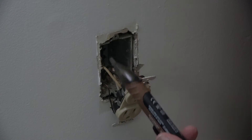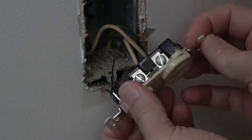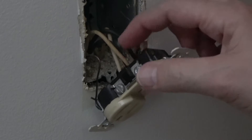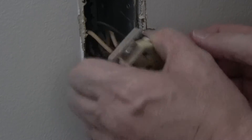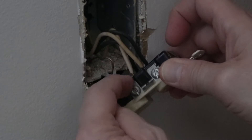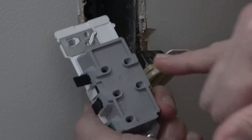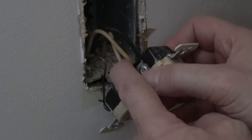It's always wise to test this on a live circuit before testing a circuit that's unknown. Satisfied that our circuit is de-energized, I look and even though there are side terminals on this, it's wired directly into the back. These are the old push-ins which you can only use once, and the problem with these is that sometimes if you shake the outlet, they'll work loose. You'll see there's a little bit of exposed wire on this neutral, so these aren't as good as with the Leviton, because the Leviton actually uses a lever, so when you go in there, it actually clamps down and holds the wire. Whereas this is just a little spring clip.